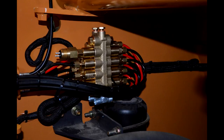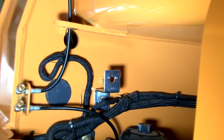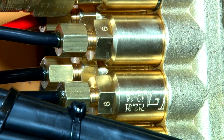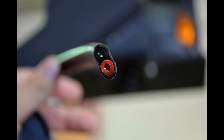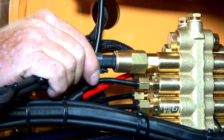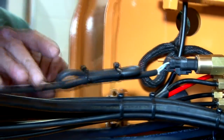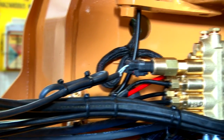Prepping the B1 block: first, identify the injector sizes and what point they will deliver grease to. You may need to make this block from scratch or simply modify the current block configuration. Mount the B1 block. Once injectors are identified and the locations they will serve, you must mark your lines. This can be done by cutting the ends with simple cuts, applying colored zip ties, or marking with tape — any form that will help you determine where the lines go. As a rule of thumb, black line always denotes the larger injector and red line is the smaller injector. You will need to plug in your pump switch to the B1 block. Notice how we've kept a service loop here in case any additional work needs to be done in the future. This cable will route to under the cab where it will connect with the rest of the electronics.